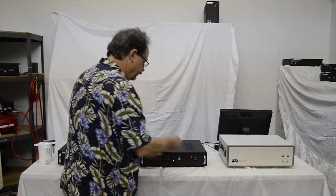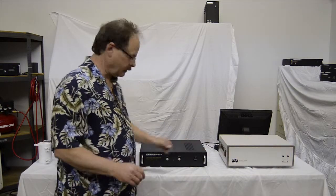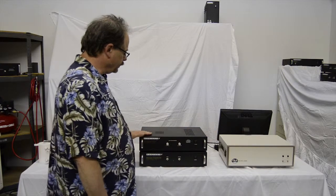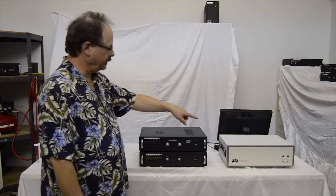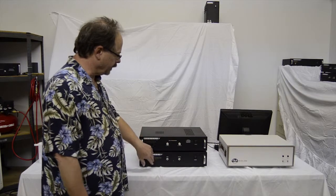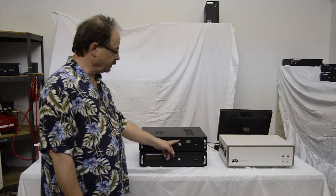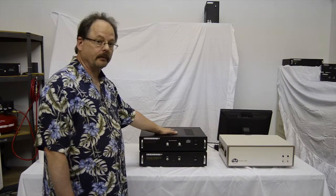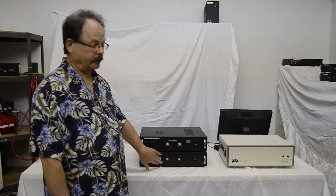To demonstrate high voltage connections, I'm going to remove the low voltage connections from the front panel of the tester. I'll put the High Voltage Interface on top of the tester — it stacks very well. The HVI is an exchange between the low voltage signal out of the tester into the amplifier, the high voltage signal from the amplifier to the sample, and the return signal from the sample back to the tester. It also detects a possible short in the sample that would put high voltage on the return port. If it detects high voltage on the return port, the HVI trips, providing signal security for both the tester and human beings at up to 10,000 volts.